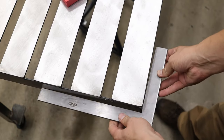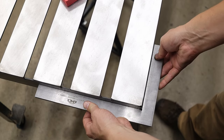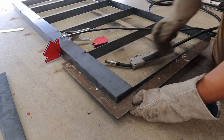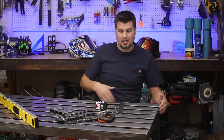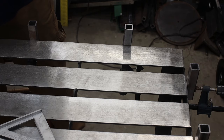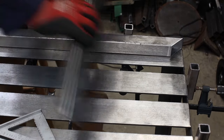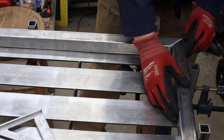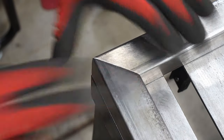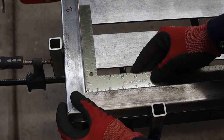I wanted my corners to be right on 90 degrees and square, and they are. I did it just by double and triple checking those angles as I was fitting up those pieces. You'll notice I actually put a bar right on the outside around the whole border so I could add clamps, stops, or vertical pieces. If I've got something out there, I can just take my workpiece and butt it up right against wherever I want, making fit-up and setup so much easier and quicker, knowing that everything is at right 90 degrees, perfectly straight.